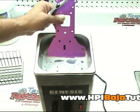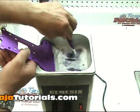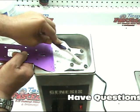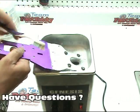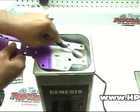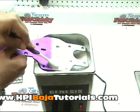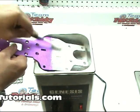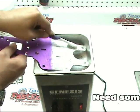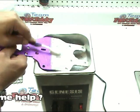A few areas on this chassis part are being a little stubborn, so we're going to use a toothbrush to aid those spots along. It works really well — you can also use a Scotch-Brite pad if you'd like. I'm going to flip the chassis around, wash it off first, then de-anodize the other half.